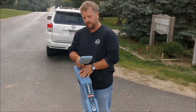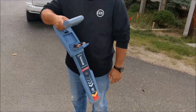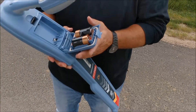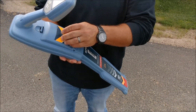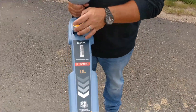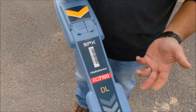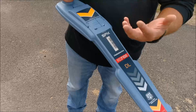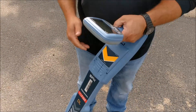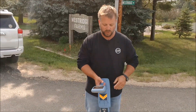This unit runs off of two D cell batteries — the battery icon is on the left of the screen. You can get rechargeables; a lithium ion will go in here and it will have a charging point on the outside so you don't have to open it to charge it. On the front here, you have a headphone jack and an external antenna jack. If you've got the PL model, it does fault finding, so you can plug in an A-frame for fault locating on wires. You can also get a submersible antenna, a stethoscope, and other accessories for this.